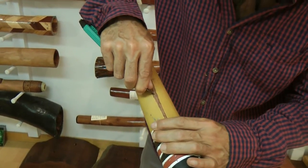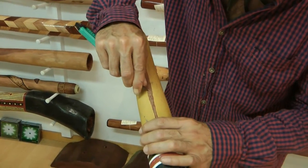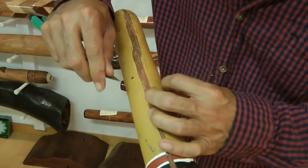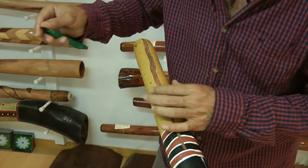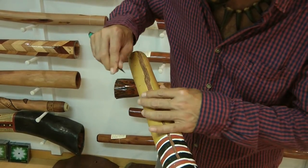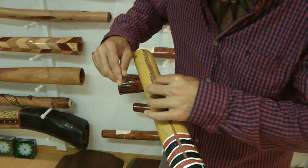We're going to widen that crack open because we want to put a lot of material in there, and that way we get a nice, strong bond around the crack surface itself. As you can see, I'm lifting it out as we go along. Make sure you watch out for getting splinters. I don't know how many times I've gotten a splinter. There we go, we just do that. We're just opening it up a little bit as we go.